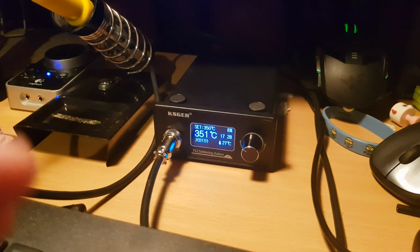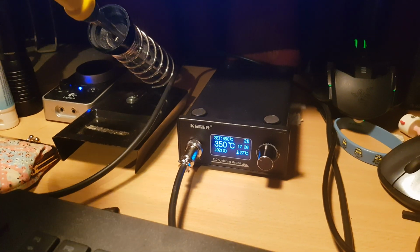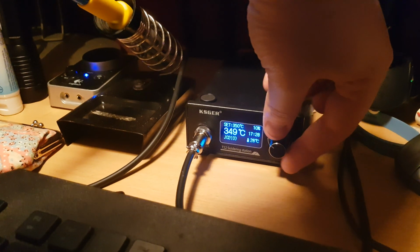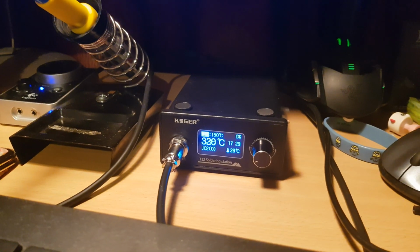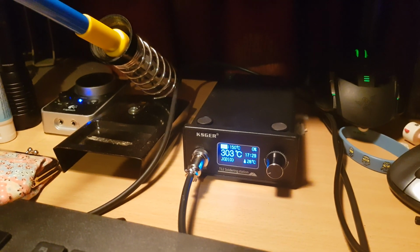So one of them is, if you don't use it for a while, there's a movement sensor in the soldering iron itself. The text shows how long it's been set down for, but I can put it into standby mode manually, like that. So that's in standby mode, and that's setting the temperature to 150 C. So that's now going down. So let's let it go to 300.